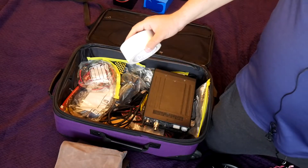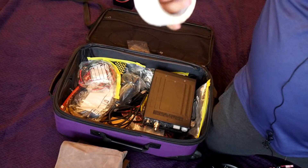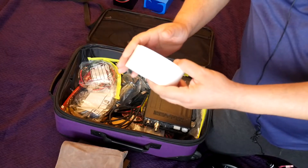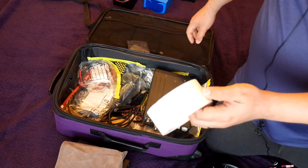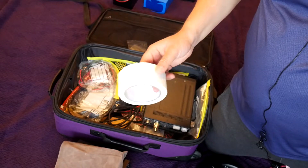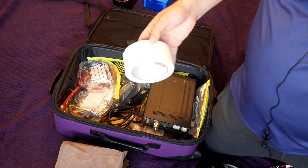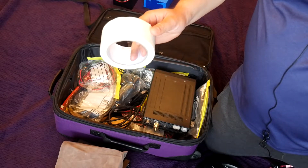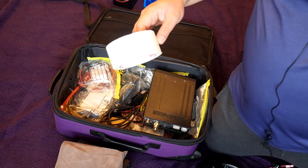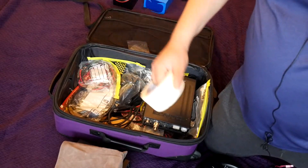Securing the antenna — you saw the wire I was using. Basically I use a very long fishing pole, about 10 or 11 meters right now; it used to be 12 meters but it broke and now it's shorter. To secure the wire along it I use masking tape. Masking tape is very suitable because it doesn't leave residue after you remove it — I've tried duct tape but it gets sticky. The masking tape is cleaner to remove. When you use a pole you want the connections between the separate pieces to be pretty clean, and that holds the antenna. Also, if you make those connections exactly where the pole pieces join, it helps prevent them from collapsing from wind, so once you deploy the antenna it keeps it deployed better.